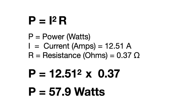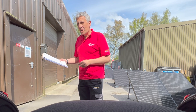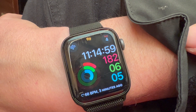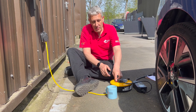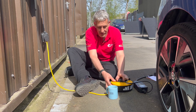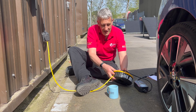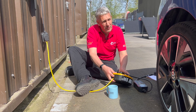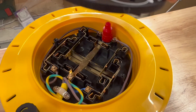That's essentially having a small heater trapped inside the middle of our cable reel. Now it's 11:15 — about 30 minutes since we started the car charging — and reassuringly the thermal trip has just cut out, so the car has now stopped charging. If I put my finger in the side of the reel underneath into some of those inner layers of the PVC cable, it's now red hot. It's reassuring that it's happened, however is that really enough for this trial? What would happen if we removed the thermal cutout?